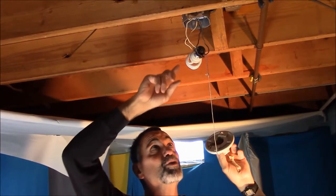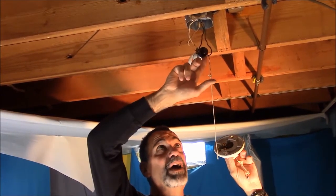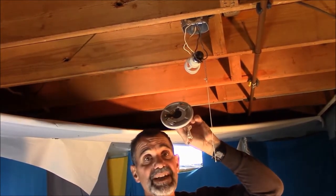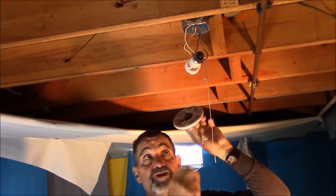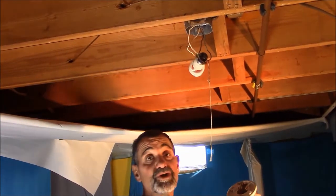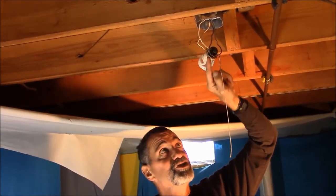So here we have an old fixture that has four screws - two whites and two brass or blacks. We happened to get a new light fixture pull chain to change it, but we got one that only had one screw each. Well, we need wire nuts and the ability to pigtail to use that fixture. So what we did is we went out and bought another pull chain fixture with four screws. We've already obviously killed the power - you can see these screws here.